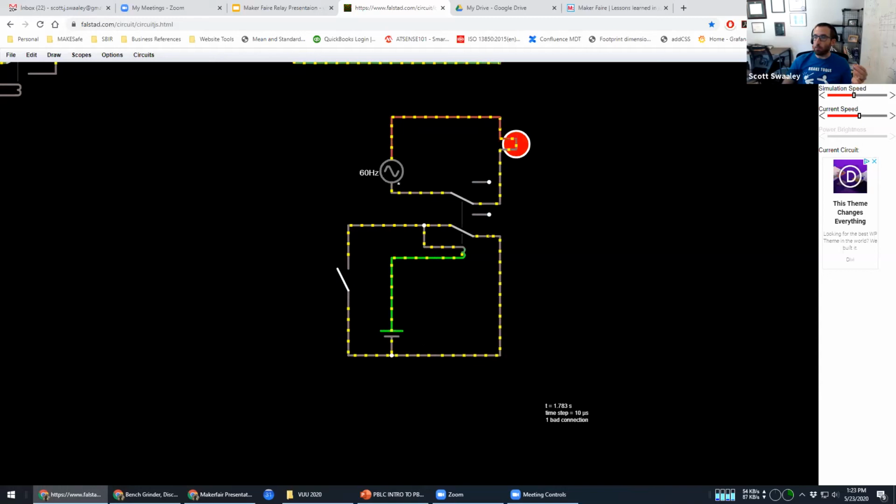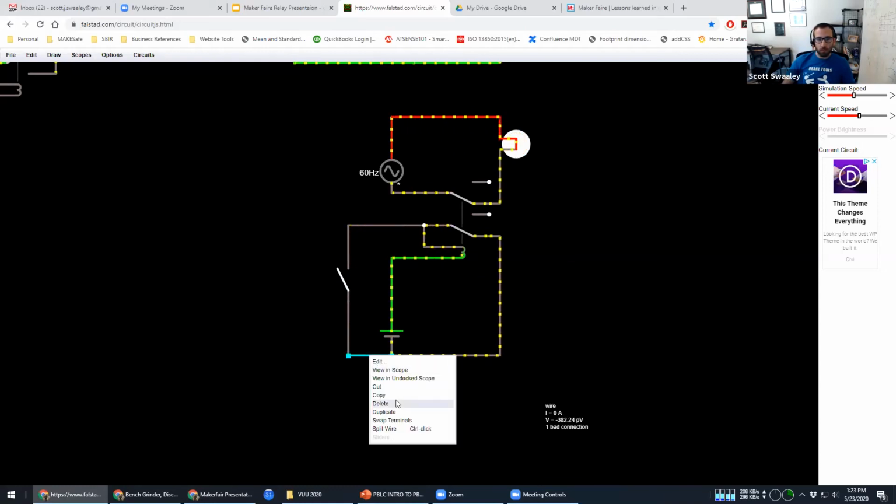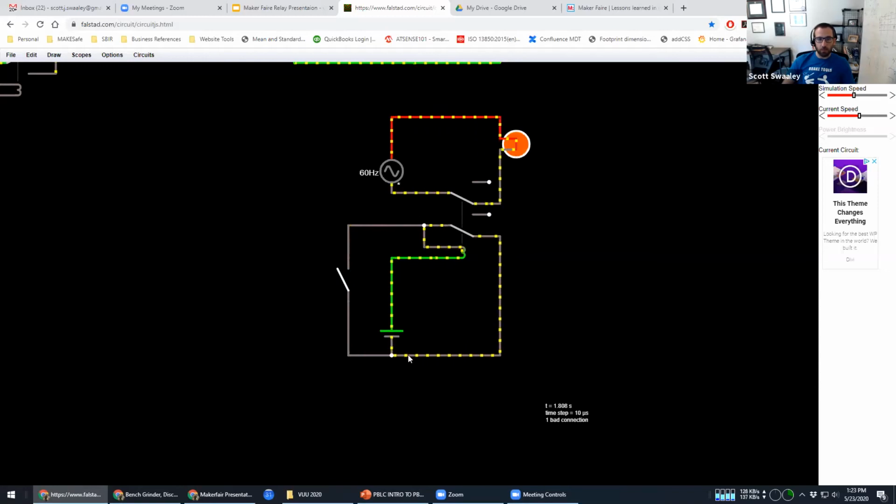And that's something that's very, very common. It's just a few wires you add to any double pole relay, and you can use it as a latch-on circuit. Now you can also have a switch over here to turn it off. But the advantage of this is that if you lose power or you unplug it, so let's say that we lost power here. So we lose power, power returns, it didn't start itself. It needs to be actively turned on again. And that is something that's sometimes called a magnetic switch, sometimes low voltage dropout, or a latching relay.